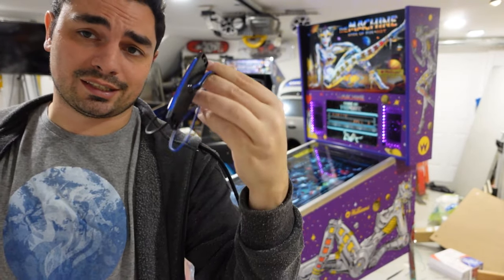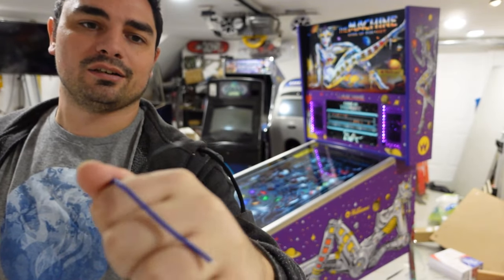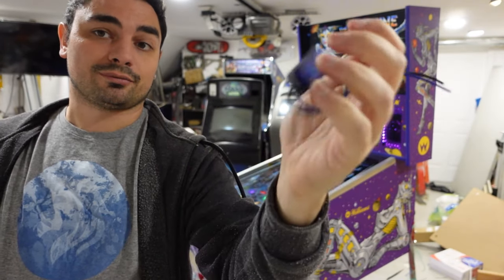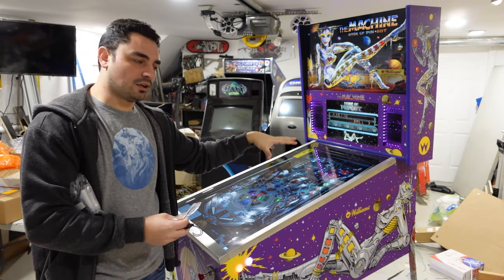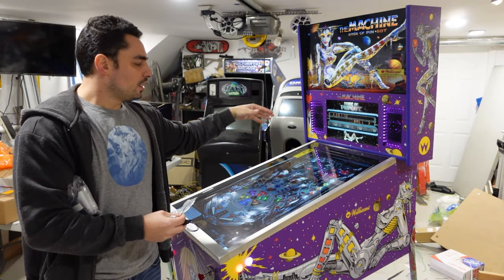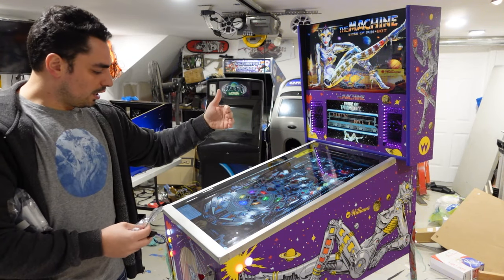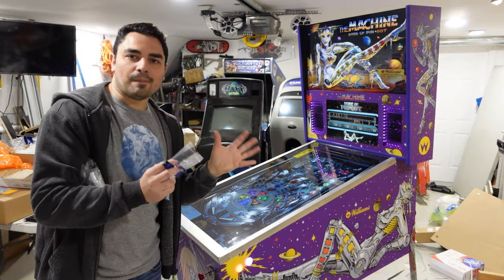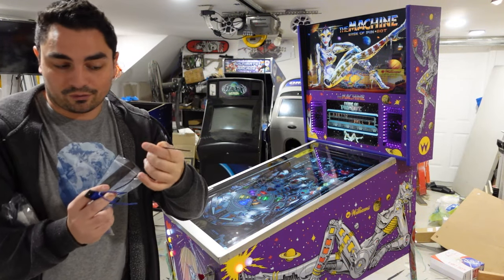It's for cars. It's got your basic standard positive and negative. And again, it's 12 volts. So that's it. Basically, if you think about it at the bottom, for example, here on the cabinet, I have two strobes, R, G, B, and then another strobe. It's kind of mapped out there, but basically the Bs are all in line together, so I wire them up.